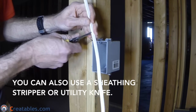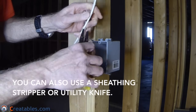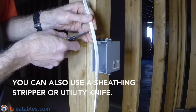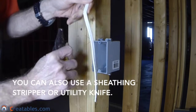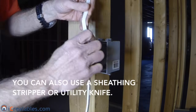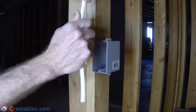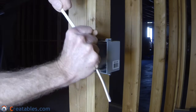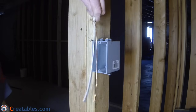I will show you how to remove the sheathing using the ends of the wire strippers. You will pinch the sheathing on the edges to break it without cutting the wire inside. You can feel the wire inside when you grab it and pull off a bit of the sheathing. Flip it around and break the other side. Now bend the wire away from one of the holes in the sheathing to stretch the surface and pull the sheathing off the end of the wires. It will break at the two holes you made in the sheathing.